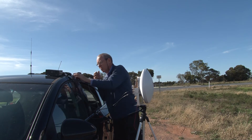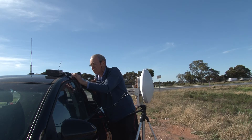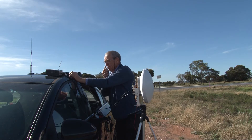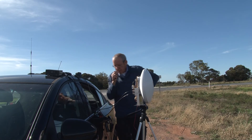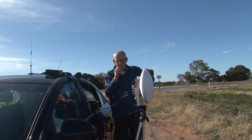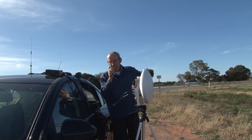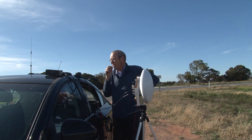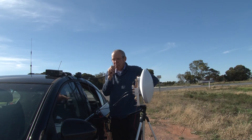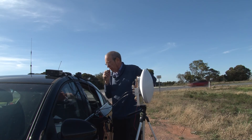No worries, you're fine. That's quite good. There's 5, 6 on the S meter there. That is too annoying, but that's quite good. You wouldn't want to get much weaker than this, which probably explains why I couldn't hear anything up at Culpara. As I said, about S2, kind of a noisy signal, you know, hiss in the background. Not super duper strong, and if you took another 10 dB off the signal, I probably wouldn't hear you at all over.